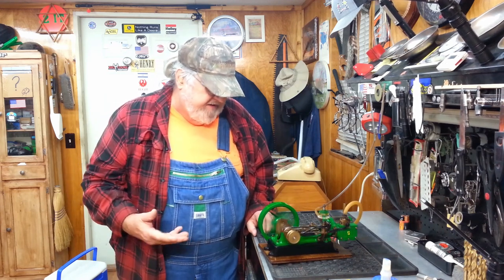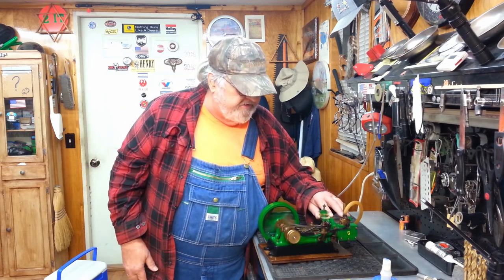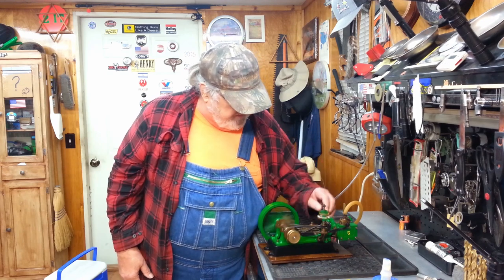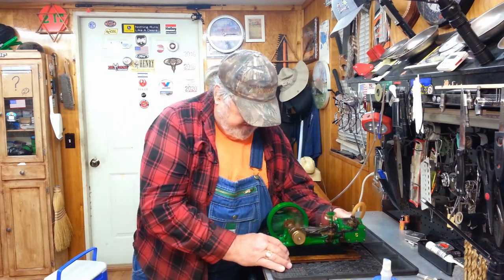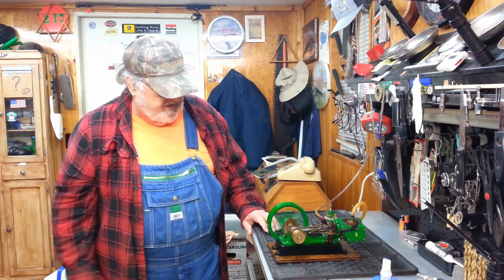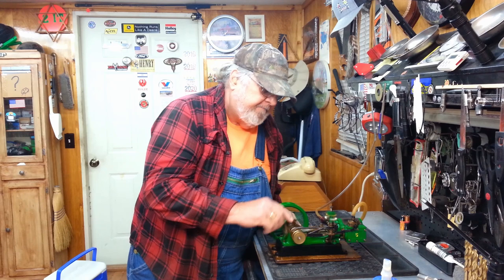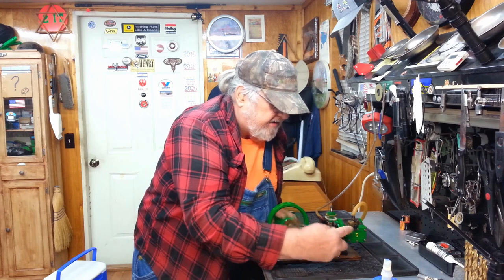And a steam engine ain't nothing but a regular engine, but it's run with pressure of steam or air or whichever you want. And it's kind of neat. This is what they call a Stuart engine. They actually come from overseas, and I've ended up with two of them. Both of them were in pretty rough shape. People didn't really realize what they had, and I had to take them all apart and clean them up. And I actually machined this little belt pulley here for this one. And here's the belt that picks the speed up off your crank and transfers it over to this thing with the balls, which actually works this governor rod here that cuts it off and on.